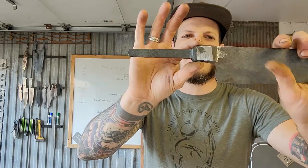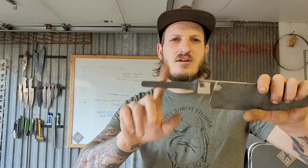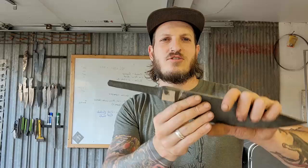The first thing I did was isolate the tang material so that I had enough material for the tang. The blade doesn't matter as much because you're going to be able to get the material out, and as you can see I have extra bolster material here that I can remove. But if you isolate the tang first, you don't have to worry about not having enough material at the bolster area to get your tang once everything has been forged out already — it makes it really difficult and sloppy.